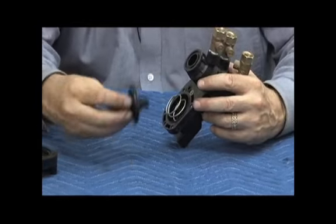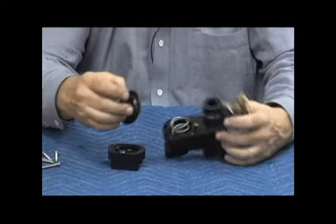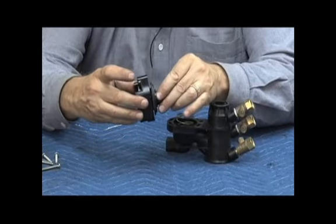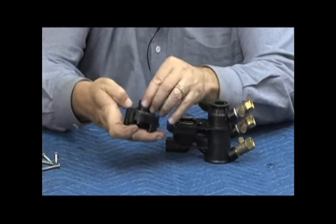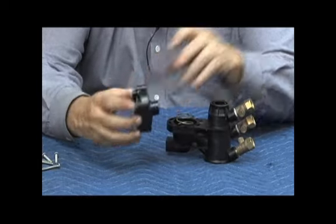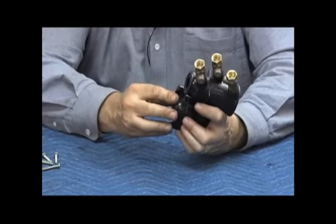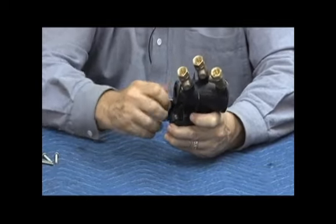Relief valve seat, relief valve stem, relief valve cover. Now, the O-ring on the top of this stem goes just like this and sits inside the cover. So your best bet is to place that into the cover first. Fold your rolling diaphragm down so that it's mounted inside here. Stroke it back and forth, make sure it moves easily and breathes across the back side of that. Now, make sure you replace your O-ring on the high pressure sensing line, reattaching the relief valve, put your six bolts back in.